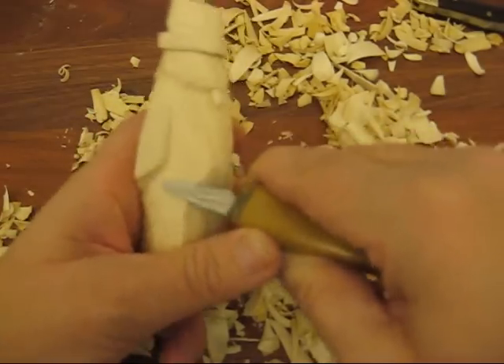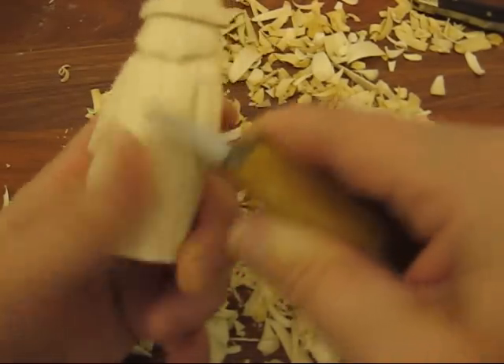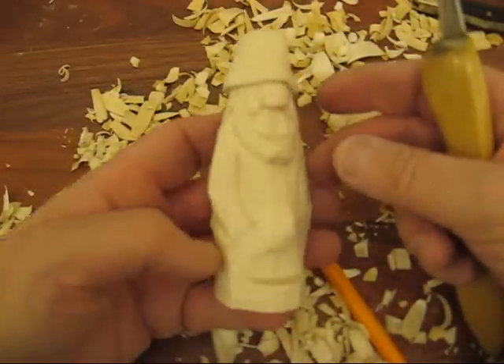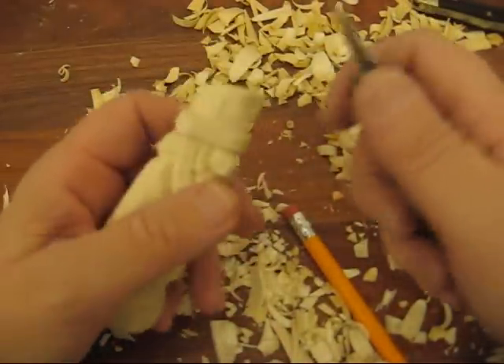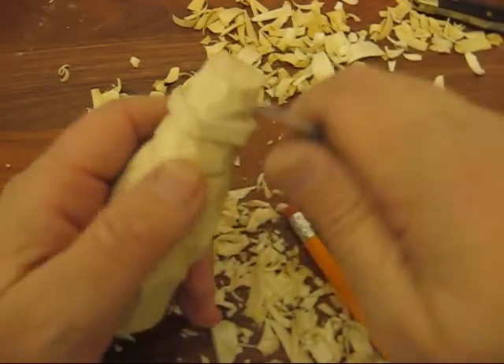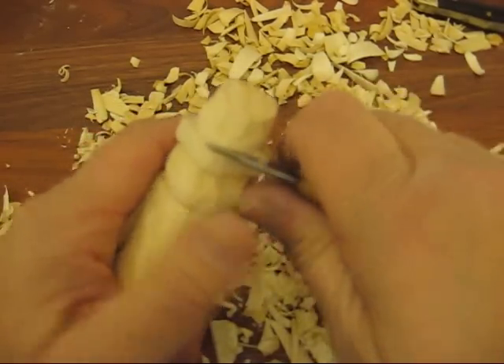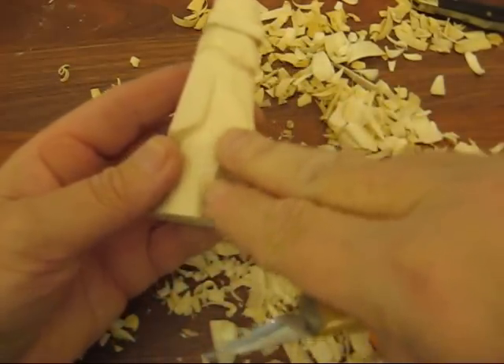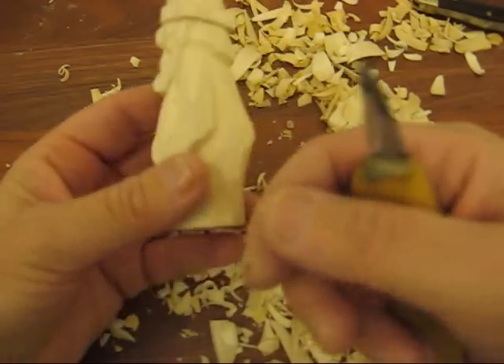Remember, you're going to take off all the rough spots, because if you don't, you're going to end up with a real difficult way of painting it — because it's going to show up. The spots that you don't cut off from the band saw, like this here, you're going to end up seeing that it's going to get much darker.